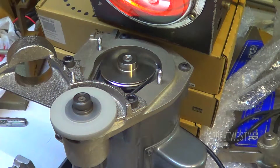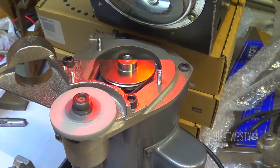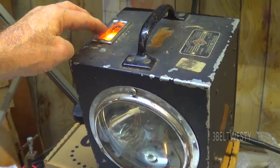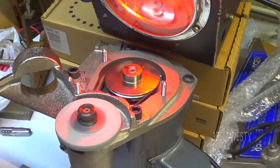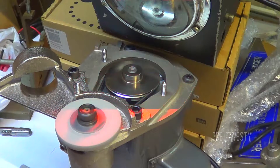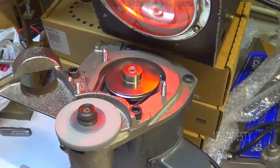I've got it pretty much to stop — reads about 1780 on the RPM scale. That's the motor. The pulley ratio on this looks like it's roughly three and a half to one, just eyeballing it. I'm going to go ahead and change speed here.